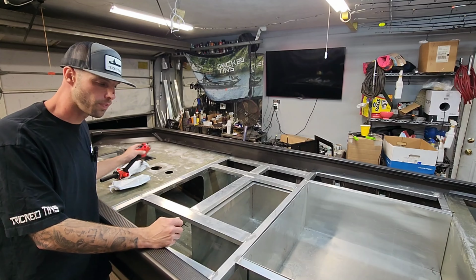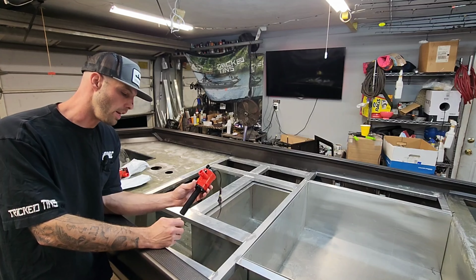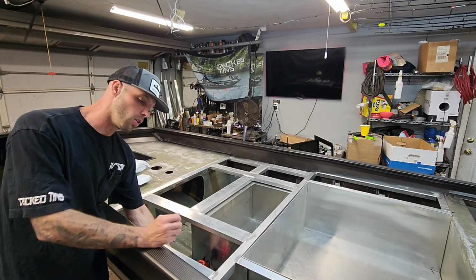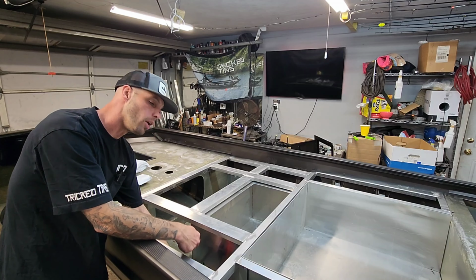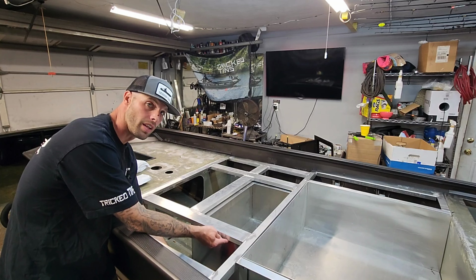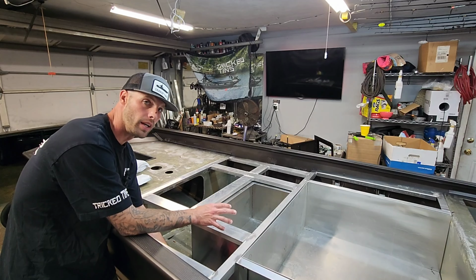We've got two pumps. So one pump is going to be our pump in. That is going to go down in the bottom of the boat on the hull and come out of the side, right on the side, right through here. That pump is going to come from there up into the top of this live well with an aerator sprayer. That's gonna be our main sprayer in.